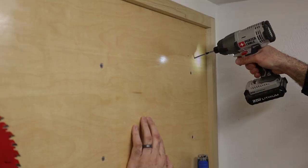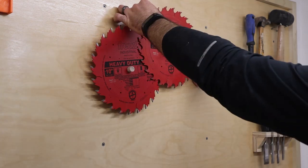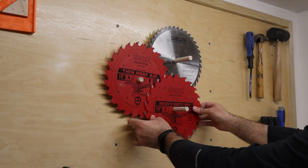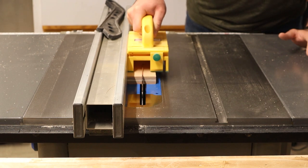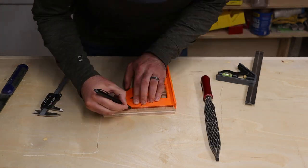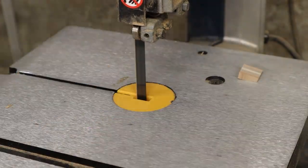I used some longer screws to hold up my hammers. At that point I looked at the saw blade and thought it would be cool to add two more, positioned in a way that matched my logo. My block plane holder was made from plywood with some maple edge banding around the front to add a lip so it wouldn't fall off as easily. For my chisels, I drilled holes into a piece of plywood and then used the bandsaw to make a cut from the front of the piece to each hole so the chisels could fit inside. For my file, rasp, and pull saw, I took a piece of plywood, cut it down the middle, measured out each tool to determine the width and length of each opening, transferred those lines to each piece, made the cuts at the bandsaw, and glued the two pieces back together.